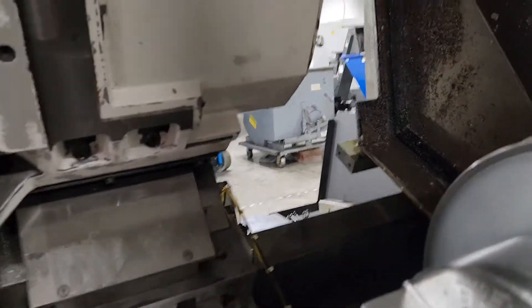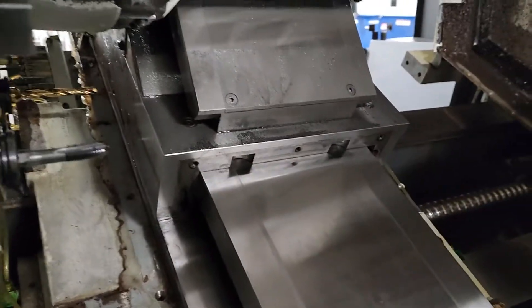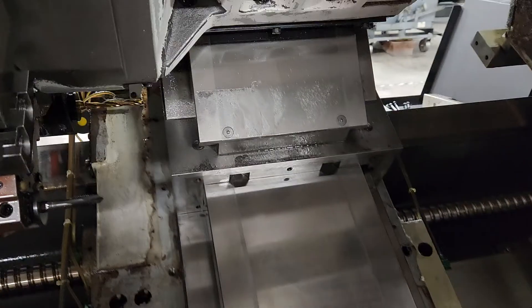The way covers come back on and all the chips get cleaned out of the machine. This is a yearly thing: hydraulic oil gets changed, the hydraulic oil filter, and both chillers — it has to be done every year, though hardly anybody does it.